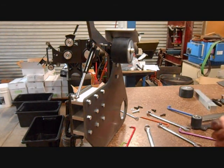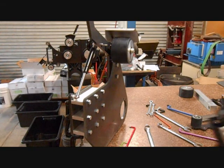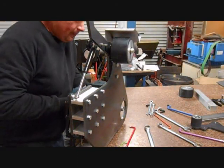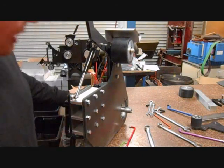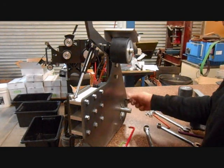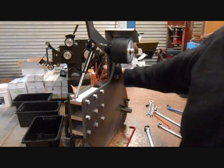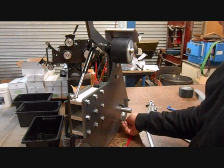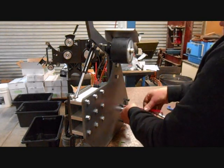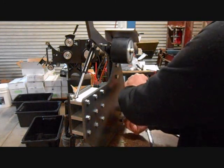You now need to bolt the motor on and the drive wheel. Depending on what sort of motor you've got — an Invertec or a TECO — your motor flange will look something like that. This one's a TECO motor. You should simply be able to line it up sitting on the bench, pop it through the hole, and there will be four M8 fasteners you can use to bolt it on. With the Invertec drive, you can position the controller so it faces you at 45 degrees, so it's easier to get to. Four bolts, 6mm Allen key, and simply do those up nice and firmly.